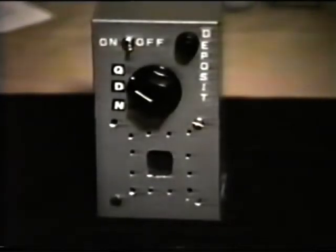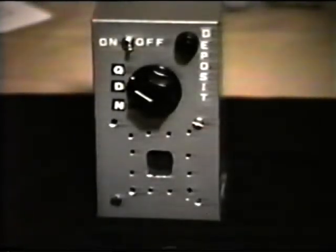We will now move on to the second most famous phone phreak box of them all, and that is the red box. The red box is perhaps the most widely used box in the United States today. As stated earlier, a red box produces the same tones as those produced when money is deposited into a pay telephone. The box in front of you at this moment produces the quarter, nickel, and dime tones. However, there are some red boxes that produce only quarter tones.